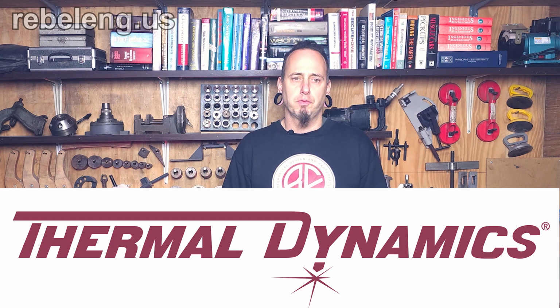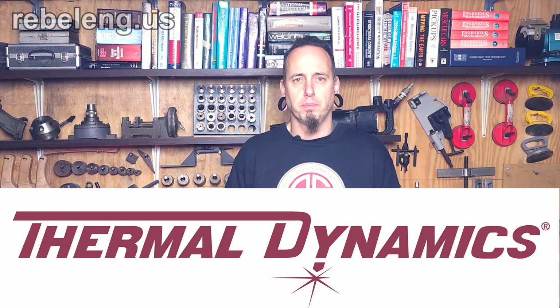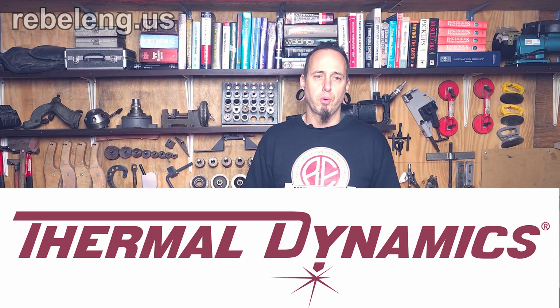Thermal Dynamics was the first major manufacturer of plasma cutters, and as the technology developed into the late 1960s, pilot arc circuitry was created that allowed a strong pilot arc that would fire the torch without being in close proximity to the plate. This used a high frequency discharge inside the torch to ionize the gas. The addition of the pilot arc would allow the ionized gas to penetrate the material being cut even if there was dirt, rust, or paint on the metal. These systems were widely used for handheld as well as mechanized cutting applications.